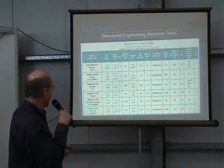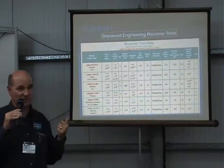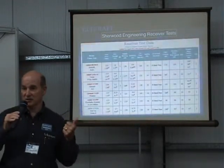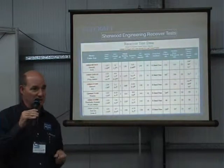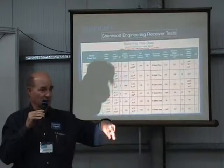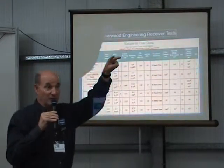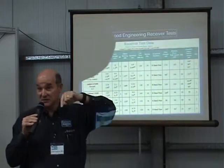We surprised a lot of people with this little KX3 because Rob ranks his tables just on close spaced 2 kilohertz intermodulation dynamic range. Basically, intermod from close stations interfering with you. You take two signals, one 2 kilohertz, one 4 kilohertz away, and crank them up in amplitude until they generate interference on the frequency you're listening to.